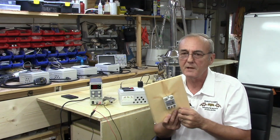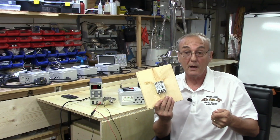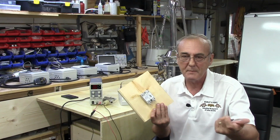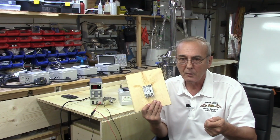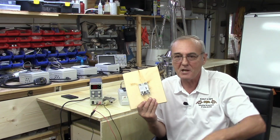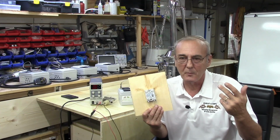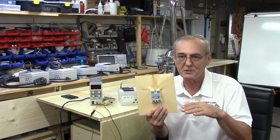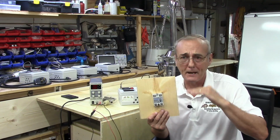You understand, sometimes you'll plug in an appliance, or you'll unplug an appliance and you get a spark. Well, just based on timing, which is sheer luck, you've pulled that plug out at a point where it was not at the zero crossing of your sine wave. That's all it is. There's a reason. You follow me? Okay. But a solid state relay doesn't allow that to happen. It only switches at the zero crossing, which makes it much, much more efficient and lasts a lot longer.